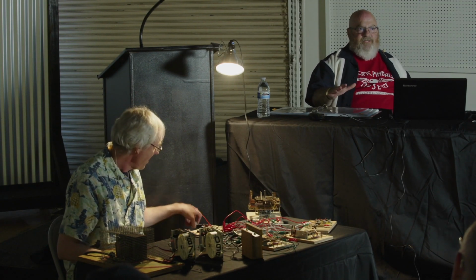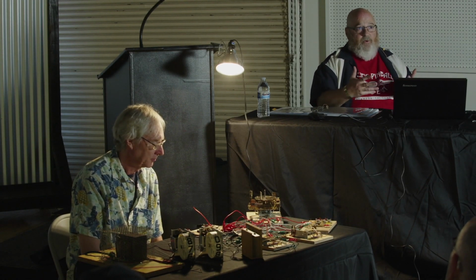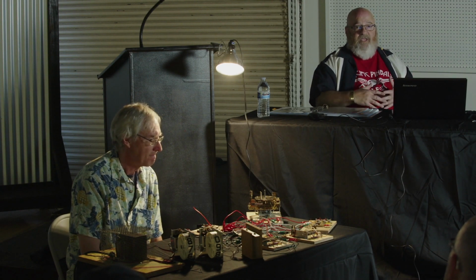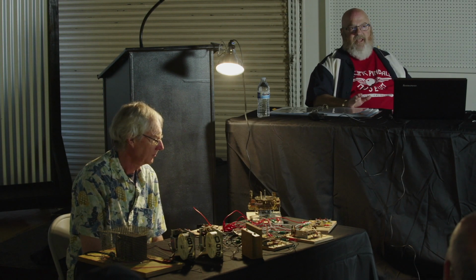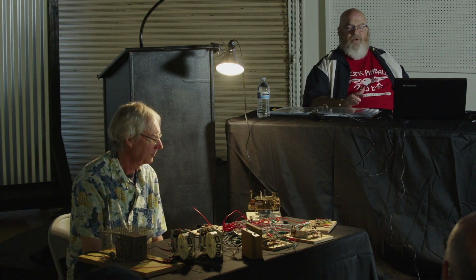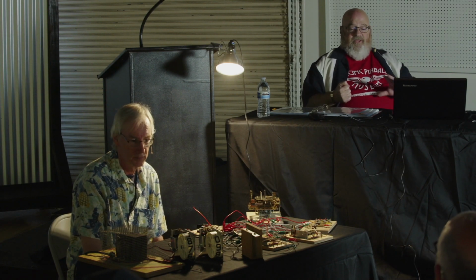Right. So there's a lot of points of friction in score reels. Different manufacturers, and different eras, had different ways you want to service that score reel to reduce that friction. In particular, on Gottliebs from the mid-60s on, they had a different score reel earlier, but from the mid-60s on, there's a way that they designed the closure of the 9 switch where there's a lot more friction, or the spring that drives the score reel has a lot more work to do. We said that you get a pulse and it pulls the plunger in. Well, the advancing of the score reel is just the spring that pulls it back out.